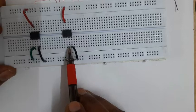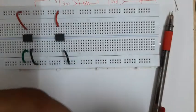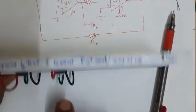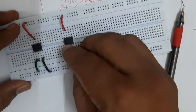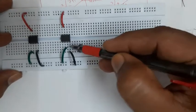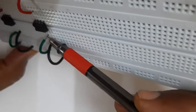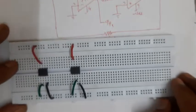This is pin number two connected to ground. Now pin number three of this IC is also to be connected to ground. I will have to ensure that - see, this is too long a wire - if I insert it with too much depth it may cross the breadboard and come out the back. So I will use a hole that is sufficiently away from the hole previously used for pin number four. You will observe that the wire is open for part of its length, and while connecting other components I must ensure it does not touch any other terminal.